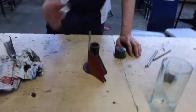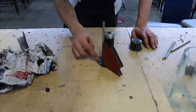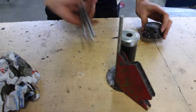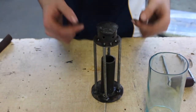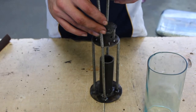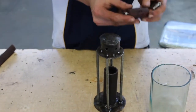For this next part, now that we have this cut and it fits, the next part is to weld on these four lengths, and then we're going to weld on the top. Now that I have these rods welded on as straight as I could possibly get them, I'm going to weld on this cap. I'm only going to weld it on by two points - that way I can put the bead over the top of the other two points, which is where this is going to go. I've already gone to the liberty of cutting this in half so I can easily slip the handle on and off as needed.